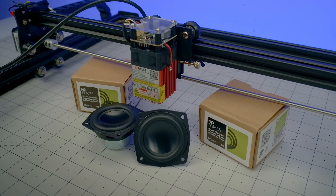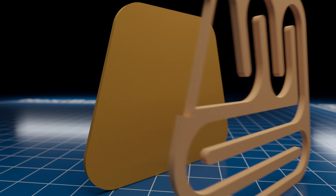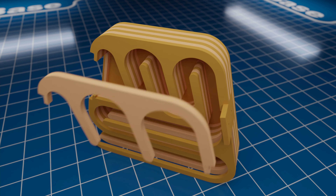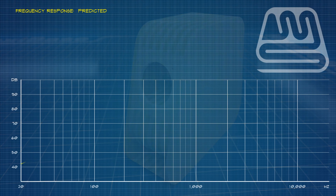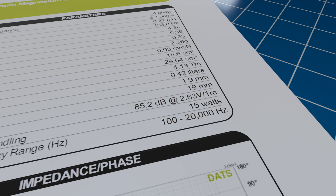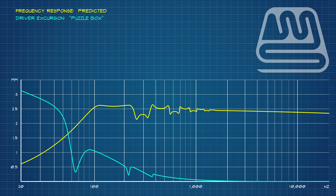Let's put this to some actual use. Here we have a pair of 2.5-inch extended-range drivers from Dayton Audio, and here's an enclosure that I designed for today's project. Taking after a trapezoid, it is a 32-piece, 14-layer puzzle which stacks to form the compression chamber, the acoustic waveguide, and a couple of insets for the perpendicular cuts — one along the back serving as a terminal plate for the binding posts, and another along the front where the driver loads into the compression chamber. When all is said and done, this miniature should play near-flat between 100Hz and about 20kHz. I'll give you a hint as to the clever bit: here we have the excursion profile of the driver loaded into the puzzle box, and just for comparison, here it is loaded into a sealed enclosure of the same external dimensions. Hold that thought, and we'll come back to it later.